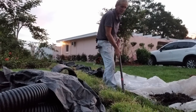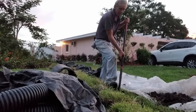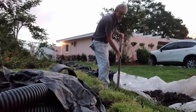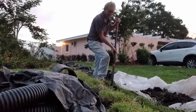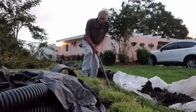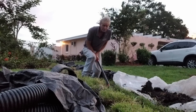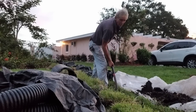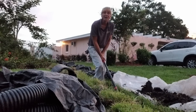We'll work backwards about 10 or 15 feet, or 5 feet, whatever you want. Then you just come back with your body weight, put the shovel against your body, and just push it. This is going to clean out that trench to the proper level every time, I promise.